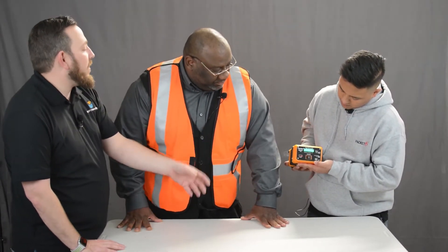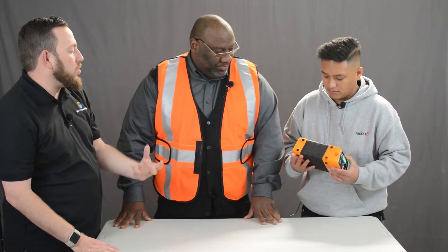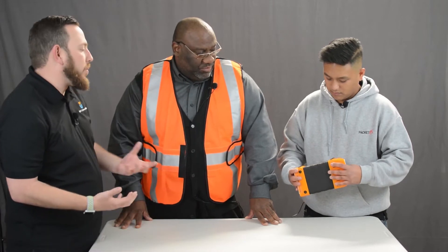One thing we talked about at Cisco Live was the PoE negotiation factor. It actually shows up as a proper PoE negotiation. I hooked a 3802 up to it and it came up and showed as a 3802 in the switch, which was really good to see. It also does a passive passthrough — so if I hooked it up to a PoE switch and the AP still powered up, you were not required to do anything extra. It's not just handing out power; it does a proper PoE negotiation.